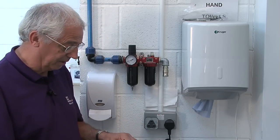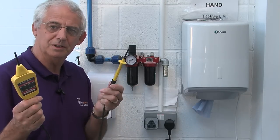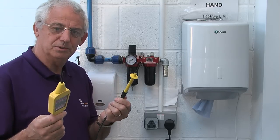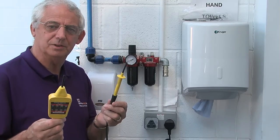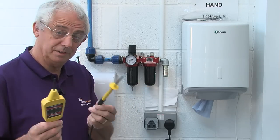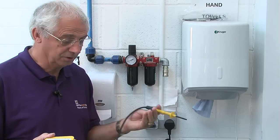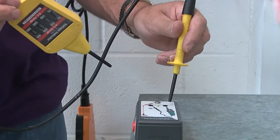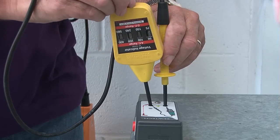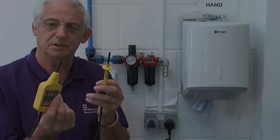Of course, I couldn't really start working on that immediately because I've no idea this is working. So what I should do is test this on a known supply. Eventually it's going to stop working — it could be at this moment. So if I've got a known supply or I can use a proving unit, I just need to push that in like so, and we see it lights up, so I'm quite comfortable that this is working.